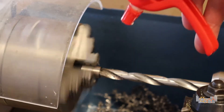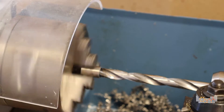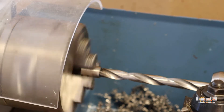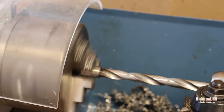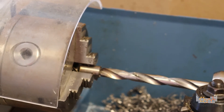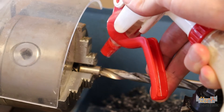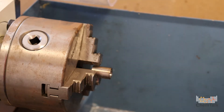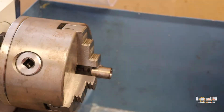So here's a good example of why titanium is so hard to machine. As you can see, that tool is really hot — you saw it boil. Titanium is such a poor conductor of heat that all the heat you generate while cutting the titanium goes straight into the tool. So you've got to be very careful and try to control your temperature. All the steam coming off of it — the liquid is not even sticking to the tool, it's so hot. When it comes to anodizing titanium, the most important thing is to make sure that the surface finish is as shiny as you can possibly get it. You don't want any surface imperfections — otherwise that will 100% show up in your final anodized product.